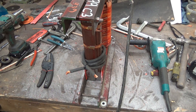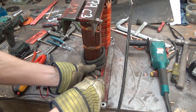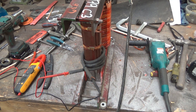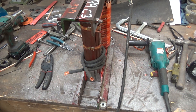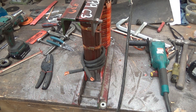In this configuration we should have one more wrap around, which should give us — let me think — 4 turns into 60, so about 7-something volts. Measured: 7.3 volts. And we should now be able to put something between the terminals that we want to heat up and see it melt.